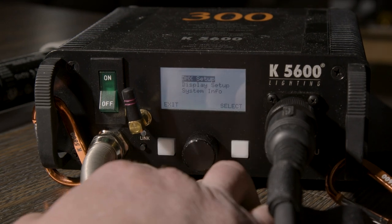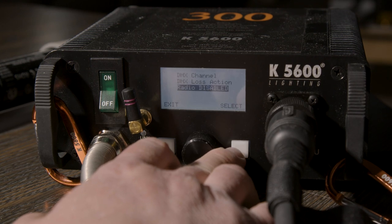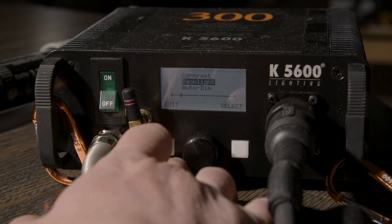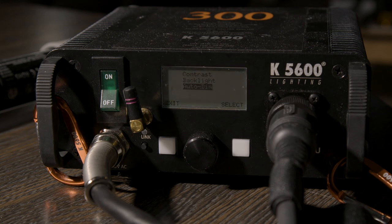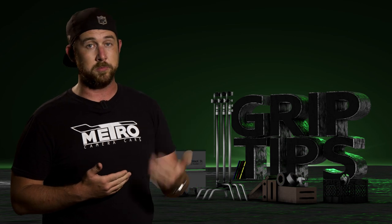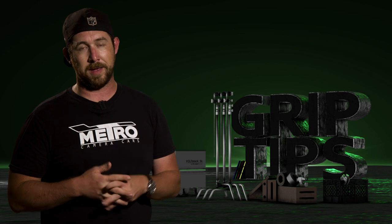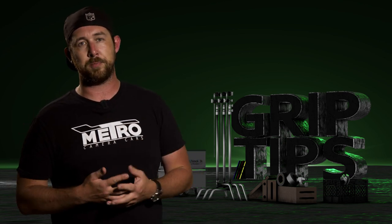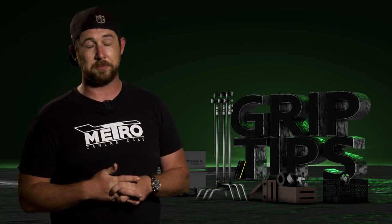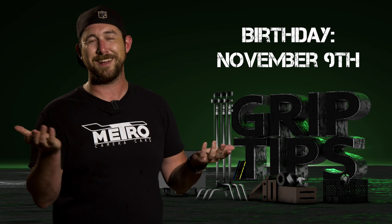Back in the menus you have DMX setup with both a wired and wireless option. You can customize the interface display — toggling contrast, display brightness, or setting it to auto-dim after a few moments. There's also the ability to check each lamp attached to the ballast in terms of watts, software, and voltage. Now let's take some light measurements. Keep in mind I'm using a Lumu Power attachment for my phone, so take the accuracy with a grain of salt — I've used it side by side with other meters and it tends to do a pretty good job but is always a little bit off.